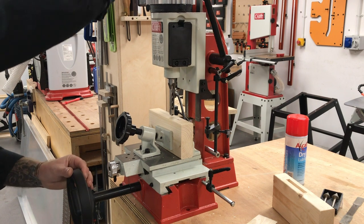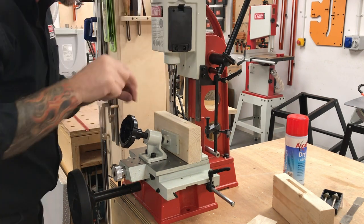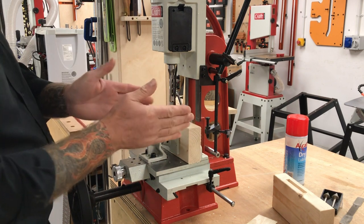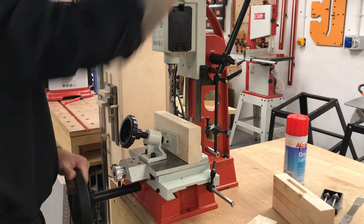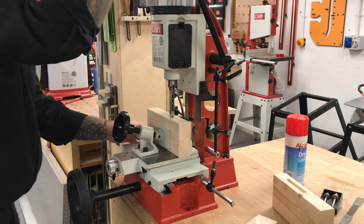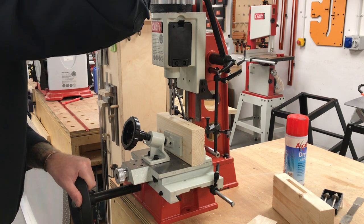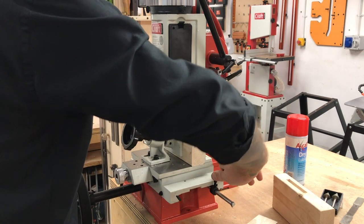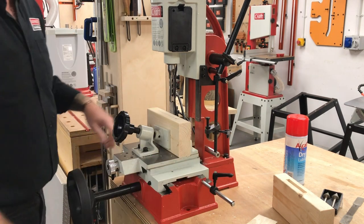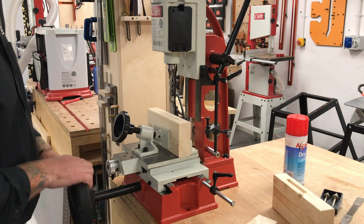I can move the table and draw this down, eyeballing it until I can plunge in and make tiny little points. That's just kissing the centre point nicely. I've made little dots all the way along with the auger point, knowing that I'm dead centre to my line. I want to control the width of my tenon and I've got these side stops. I'll offer up my square chisel to my side stop and lock this collar in place, then travel the other way and do exactly the same. At this point I've got repeat, repeat, repeat — because often you're not just doing one mortise, you might be making a table with eight to do.